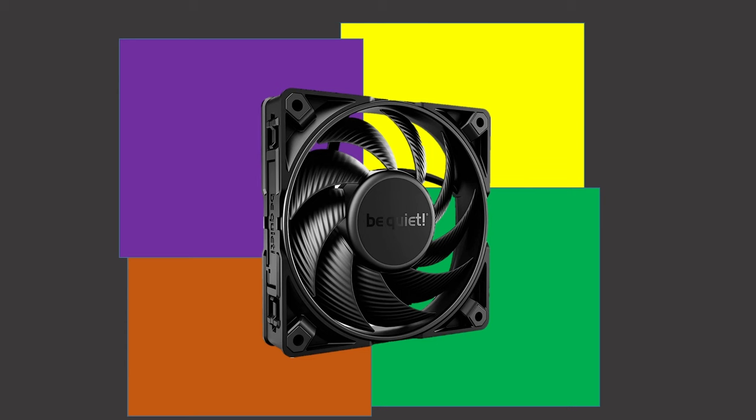Going forward, I am using a fixed distance. I actually have a pole that I'm measuring out the microphone from the fan, and I'm making sure that the room is at a consistent noise decibel of a 2 decibel range, plus or minus, to give me an overall accuracy of plus or minus 2 decibels, or a full 4 decibel range. Unfortunately, this is the level of accuracy I'm only able to generate right now with my current test setup.